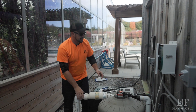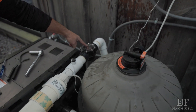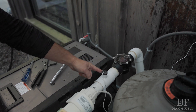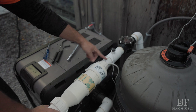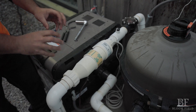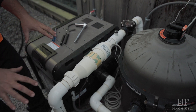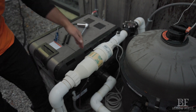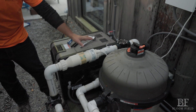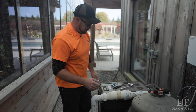So now we have the water being pumped properly, cleaned big, medium, and small, and we've warmed the water up. The water is coming out of the back pipe going up through a check valve. In order for you to have a warranty on your heater, we had to install this check valve because the bit of salt in the pool runs through the pipe past a flow switch that the computer operates, and into the salt cell which has webs that collect the salt so it's being generated into chlorine. Without a check valve, when the system is turned off, it backflows and all that salt goes into your heater causing corrosion — this is something Hayward requires and we always install one.